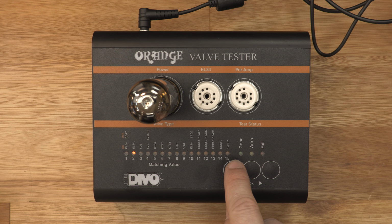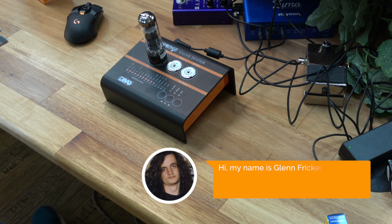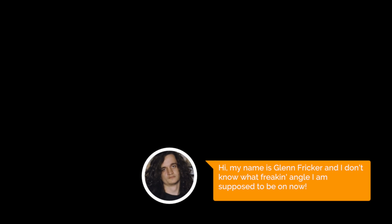Glenn, I don't think you have to do that. We recommend using protective gloves when handling it. No. Okay, see, now you can go back and forth, which I didn't do. EL34, okay. And now it's doing its thing. I think these that I used... What the... they were from the Joyo amp. So that means that the KT66 I tried to test is, of course, okay. It just tried to test it as an EL34. Because I'm an idiot.